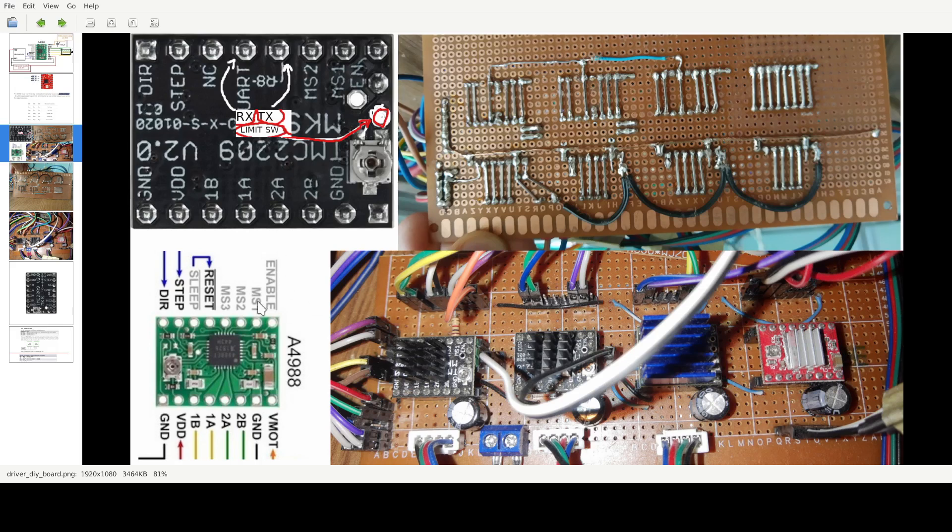The drivers are laid out exactly as shown in these pictures. The bottom part is the same — as you can see they have exactly the same layout. These four pins are where you connect the stepper motor. This one is the VMOT — the power for the drivers. And this one, the VDD and ground, is the logic voltage that you provide either from the Arduino, ESP, your MCU, or a separate line. It can be 3.3 volts or 5 volts.